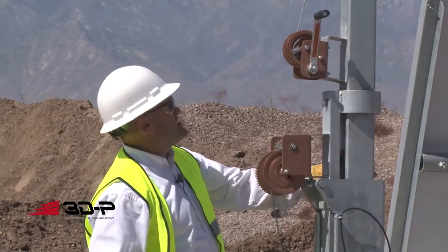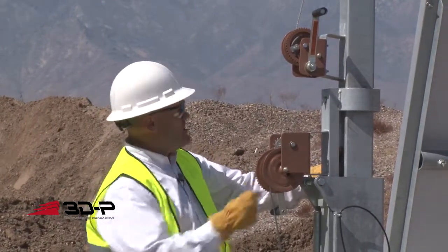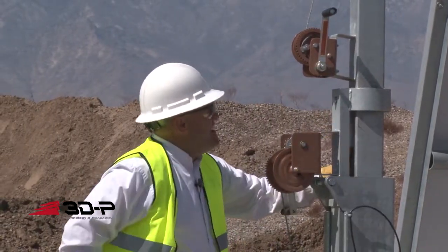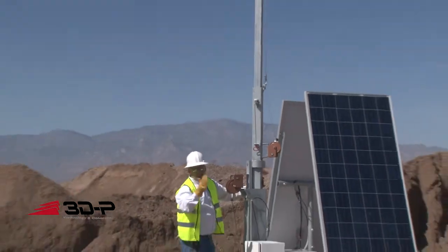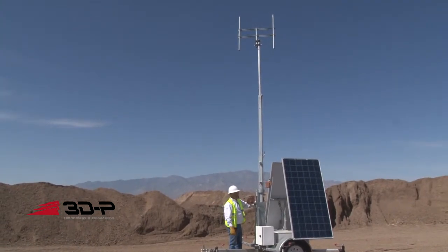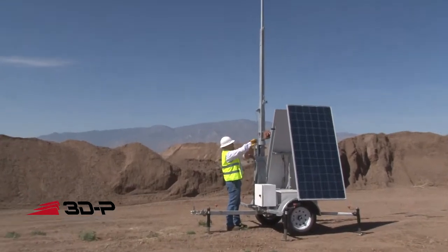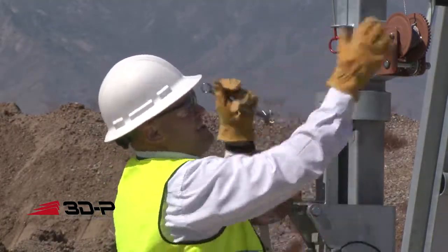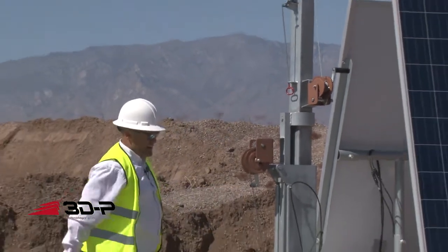The mast can rotate 360 degrees — let me show you how that's done. Once the mast is up in the vertical position, all you have to do is loosen the set screw on the front of the mast, which loosens it inside the ring. From there, you can rotate the mast to whatever direction you need. It really helps in aligning your directional antennas instead of having to constantly bring them up and down to realign. Once you've got the mast where you want it, tighten the set screw back up — with that tight, your mast is now rigid, it won't move, and you've aligned your antenna and you're deployed.